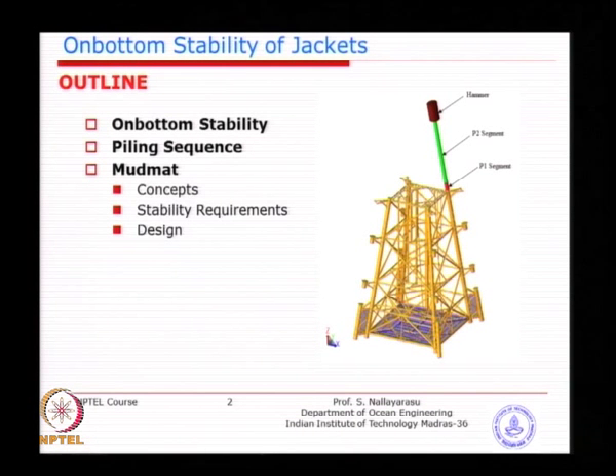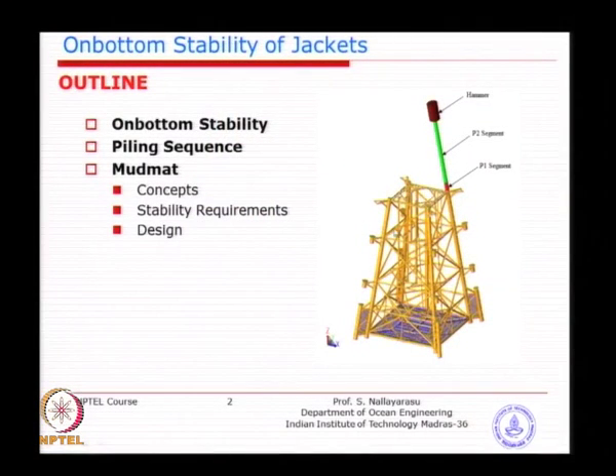You can place all 4 piles together, but if the system is unable to take the load the foundation requirements become too large. If you want to put all 4 piles together, the foundation requirement may be bigger than the jacket itself. Nobody prefers a foundation bigger than the base width of the jacket because it becomes a problem of fabrication and transportation. The foundation must be within the peripheral boundary of the jacket — at maximum you can go up to the skirt sleeve to gain a few more meters, but you don't want to protrude outside the geometry.